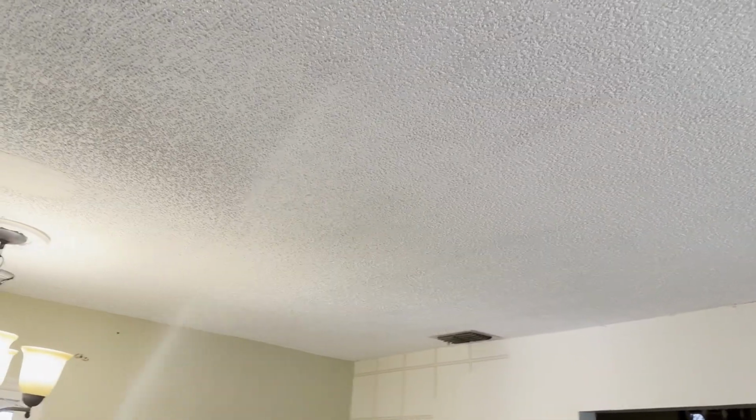It'll work. Look, you want to wet it down until you use your tool to scrape this off and you see that most of it comes down, then you've wet it enough. But in the beginning, you can't wet it enough. Don't take my word literally, but it has to be wet sufficiently to where the popcorn will come off easily. If you're just scraping over bumps, stop scraping and wet it more, because you haven't wet it enough.